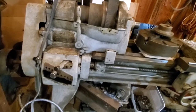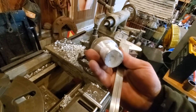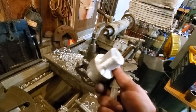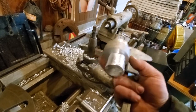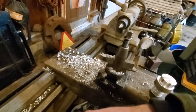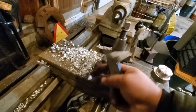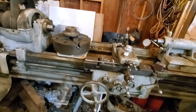I love this thing already. This is some aluminum — I don't know the alloy; it's just a plug I cast myself making ingots, nothing high quality. But just for playing around, it was fun. I was taking three-quarter-inch depth of cut, cranking it in and just peeling it off, and as long as the belt didn't slip it didn't care — it just ate it. I am so stoked about this because I've got so many plans for it.